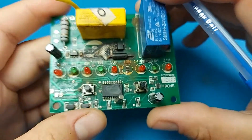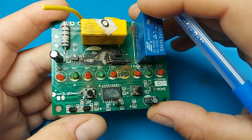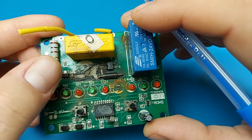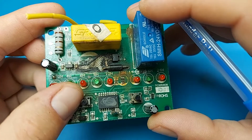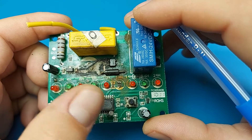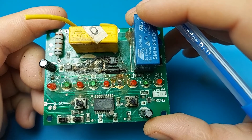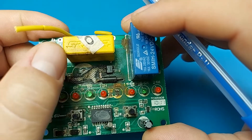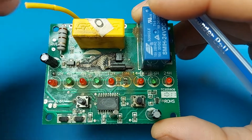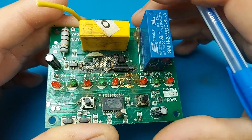Next I have this idea — I'm not sure if it's going to work or not — that I'll try to provide 5 volts after this regulator to see if the rest of the circuitry powers on, and to assess if the microcontroller is alive or not. If it is, then it might be worth rebuilding the circuitry here so we get power back through it all.